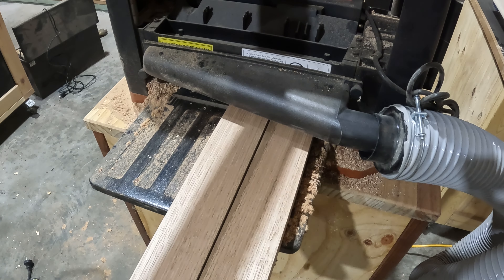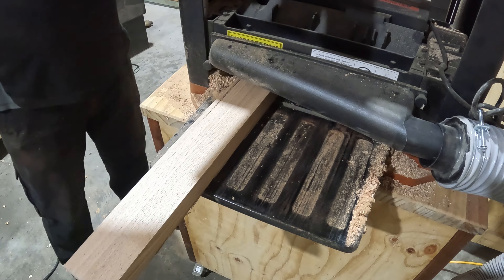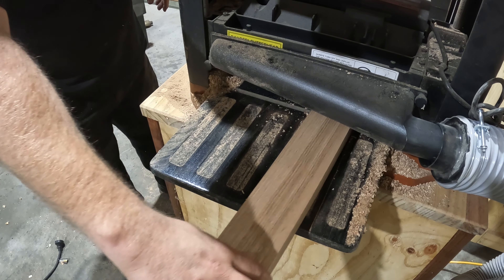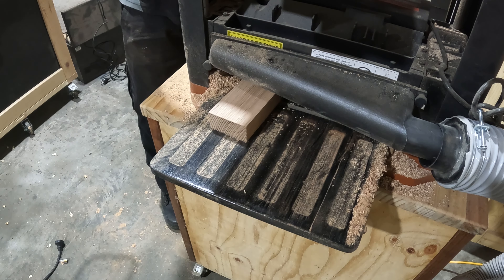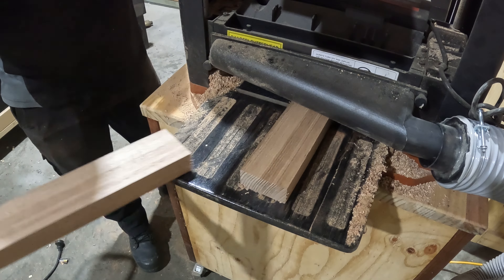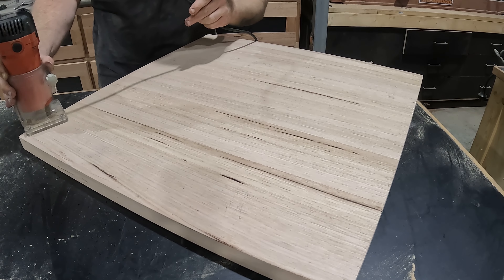While the drawers are sitting around drying, I'll start working on the panel that will become the top. Here we have a 32mm, or inch-and-a-quarter thick, Tassie oak. I'll get this one through the jointer and planer, and add a small round-over to the edges for a nice feel. After getting it all sanded and looking schmick, I'm going to apply two coats of hard wax oil — usually I would only do one, but seeing as this will live its life in my shop, the extra protection won't hurt.